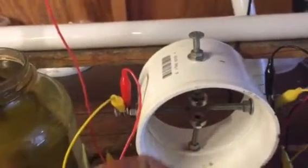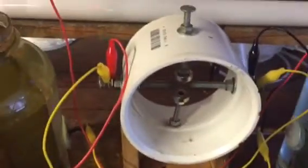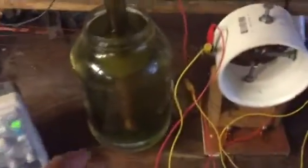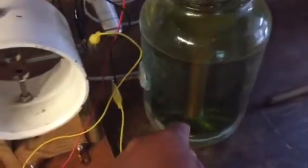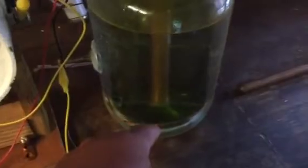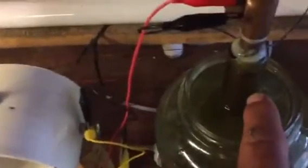As we go on in this video, the real spark gap you want is something more concealed but has access to let air in and out at the same time. These are the upright capacitors — I drilled a hole through the glass, you've got a brass rod sticking out bolted, and I've got a 10-gauge magnetic wire scraped with sandpaper on it. It comes up and goes to that bolt. The salt water I have in here is in between the center bottle glass and the outside glass — that's one plate. Then inside the bottle there's salt water, and on top I have oil in the center bottle and oil in the outer, all level across. These are high-voltage capacitors.